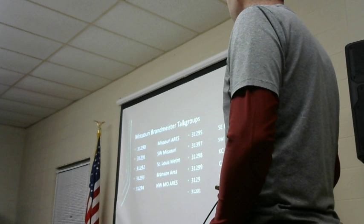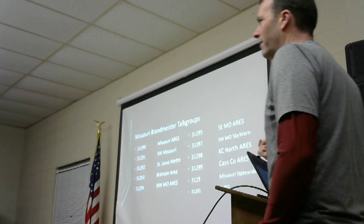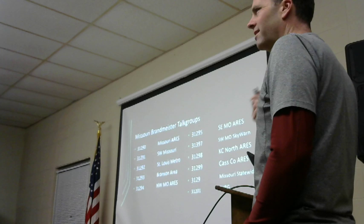I'll go down a rabbit trail here, because on the Skywarn talk group, Brad, K0KDW, was on this last severe weather net, and he was reading off the information on the DMR talk group. And I'm sitting in the basement. I can't hear the 4.9 or anything. But I got my handheld, listened to my hotspot, and listened to him on Southwest Missouri Skywarn. So it actually worked out pretty well. That's another benefit of DMR: all of a sudden you're not just reliant on a couple of repeaters. Now you can be wherever on your hotspot and have access. You could be driving down the highway with the hotspot hooked to your cell phone and be on the talk group. So a lot of benefits there.